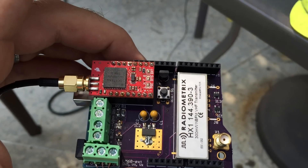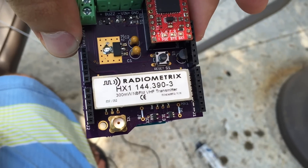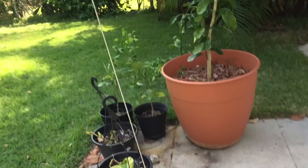I've got my Traquino built and the Traquino antenna. There's the Venus GPS that I bought from Sparkfun, and we have the Radiometrix HX1 transmitter at the US APRS frequency of 144.39. I had to build the quarter wave ground plane antenna using wire from Home Depot — I twisted it to make it straight by putting one end in a vise, the other on a drill. I used an SO239 connector which goes into the SMA connector of the Traquino, and I was tuning it making sure the radiator and the radials were all the correct length and angles.